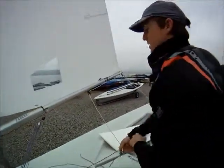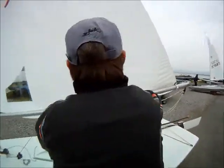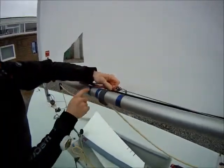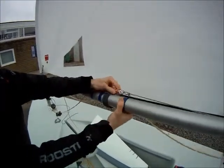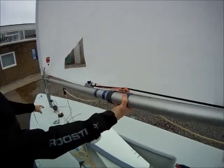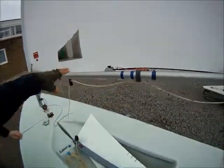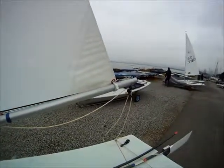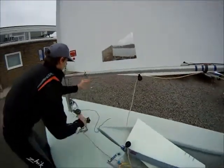And for my outhaul, I've got some marks. You can probably see a few bits of tape marked on. When this block is in line with this tape here, I know it's my maximum off. So I'm going to try and set my handle such that when the handle's in the jaw of the cleat over there, this is your reference maximum position, which is a hand span and a half, pretty sensible, 9.5 inches from the back end. Okay. Good.